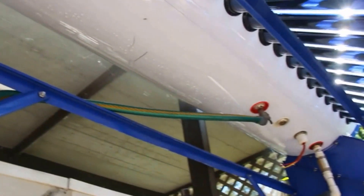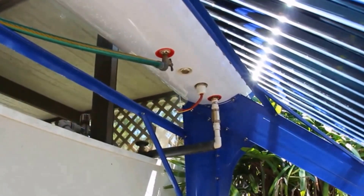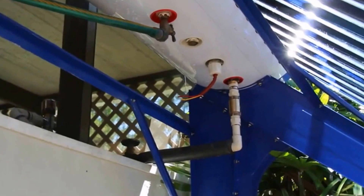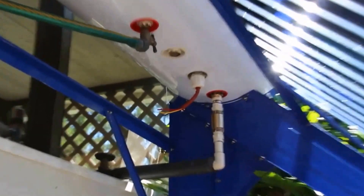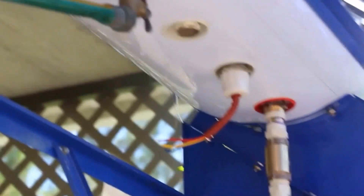Here I've got my pressure relief valve, and for safety I'm running that down here. Here's my cold water in with a check valve and my hose spigot. Right after that is the solenoid, and right after that you can see the electrical outlet for a backup water heating element.